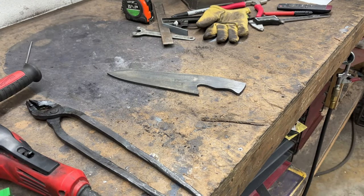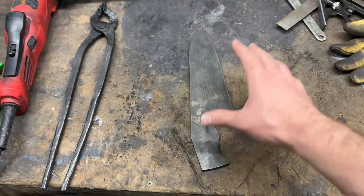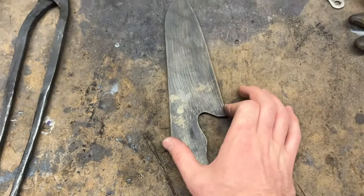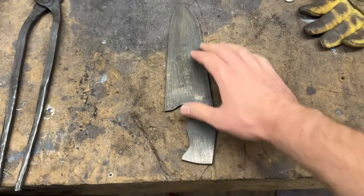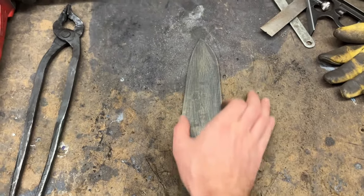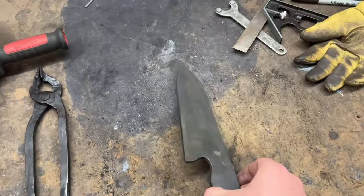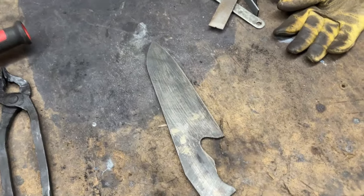We have a problem — well, not really a problem, I'm just being dramatic. I want to surface grind this blade to make it all flat and precise and beautiful and perfect. The slight problem is this part is too wide for my surface grinding attachment, so I'm just going to bring this edge down by hand, thin it out enough so that when I surface grind I can grind just this strip right here, and I'll bring that down to 180 thousandths. After I flatten this we can do the bevels to make it sharp, you know.